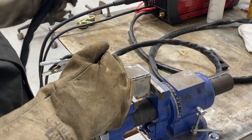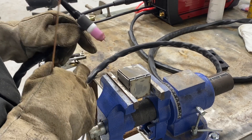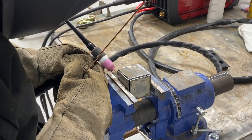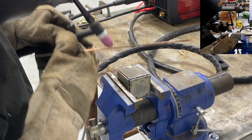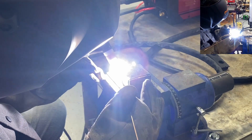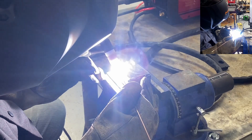One more tip: have your electrode sharpened to a nice sharp point. Do that on the grinder — you can find multiple tutorials on how to do that as well. So I'm going to turn my gas on, flip my helmet down, and we're going to start an arc. On lift TIG you've got to arc it up by touching and lifting.